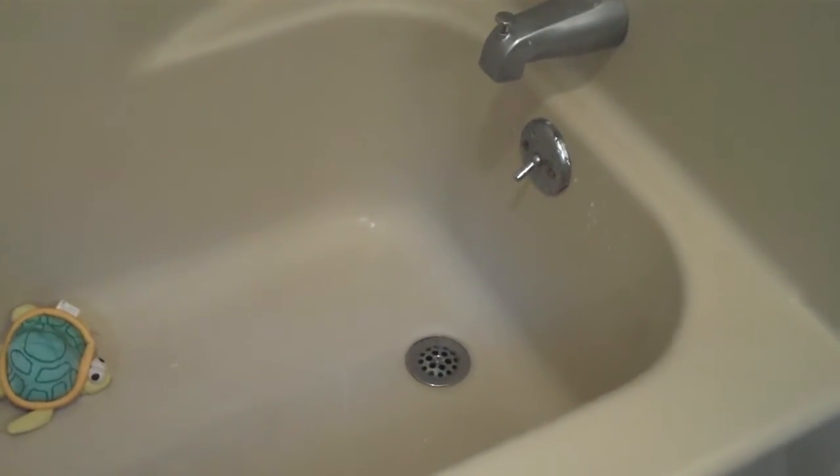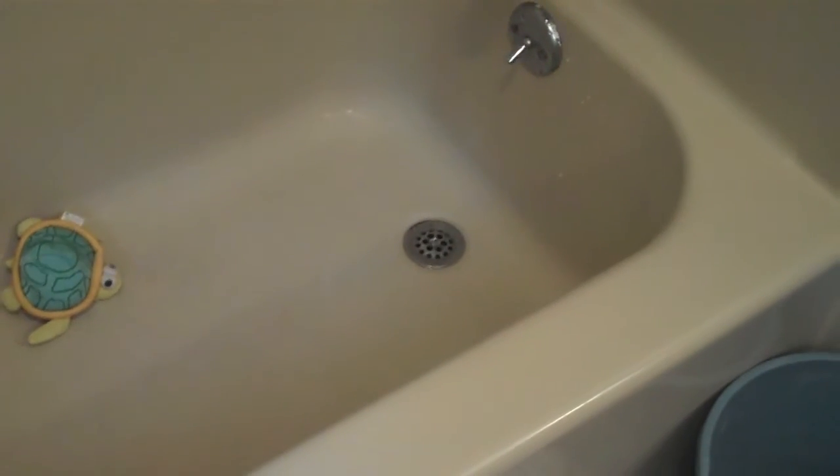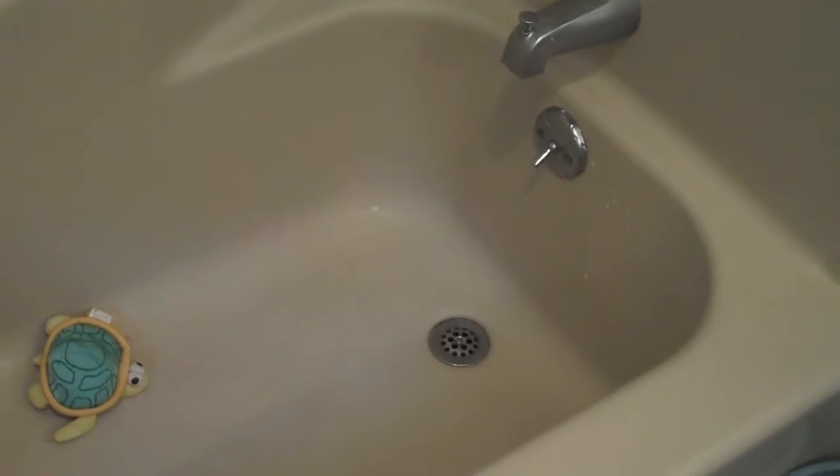You can tell from the time on this that that was about two minutes. The siren has gone off and the alarm has gone off, and that's actually now an indication of the pump-down time on my system — about two minutes. It was pumping about 20 gallons, because that's what it takes to go from the alarm on before it gets back down to the alarm-off level.